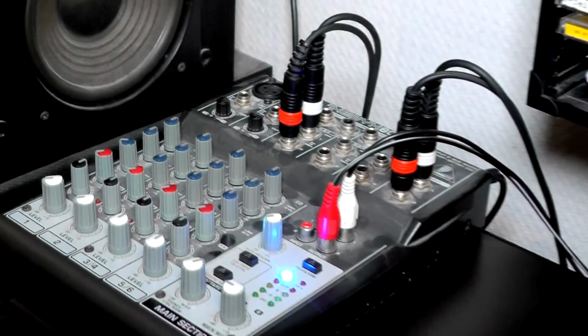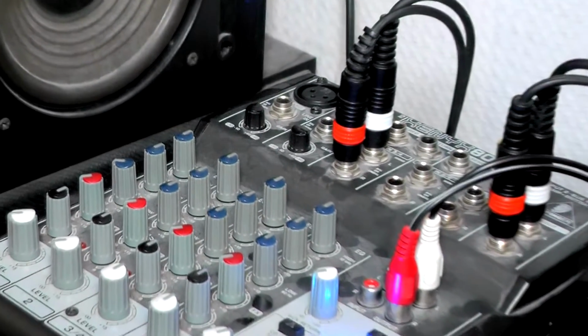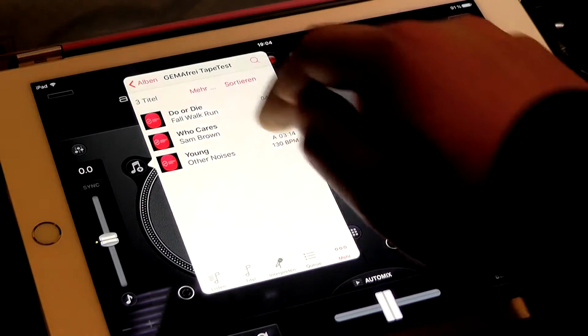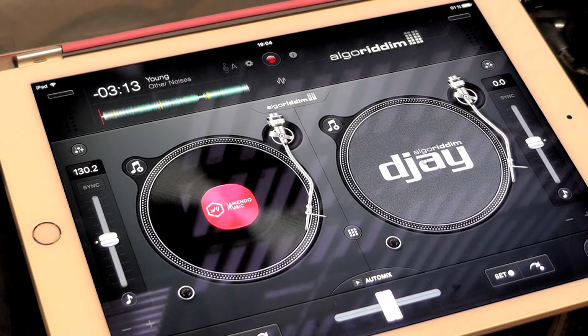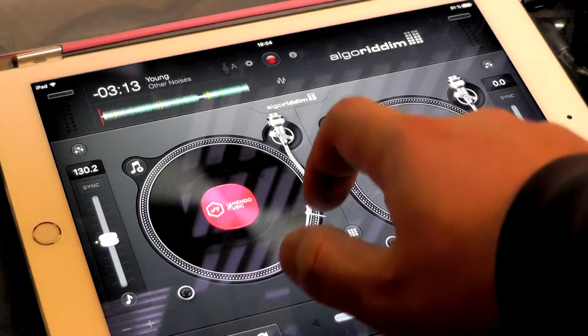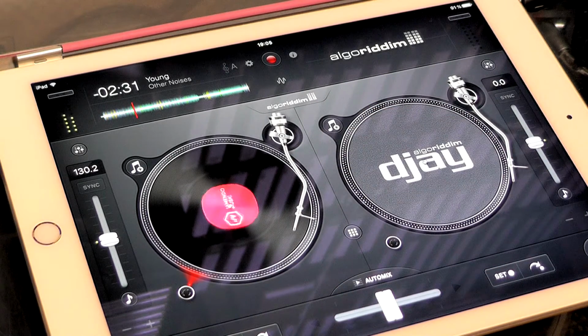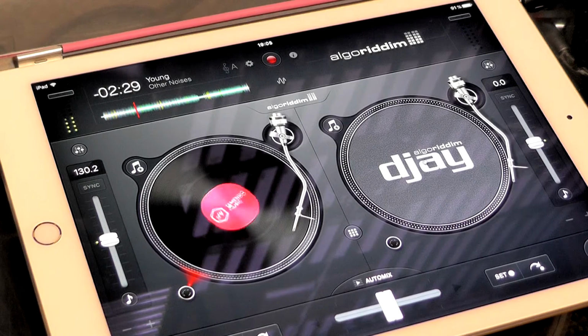I've decided to take some test recordings for you with some license-free music titles. The test recordings you can hear in this video, and if you want to hear the original files, you can find them in the video description. So I hooked up my iPad to my mixer, which is directly connected to the input of the tape deck, selected a little bit of music on it, and let it play, so that I'm able to calibrate the record volume on my deck.